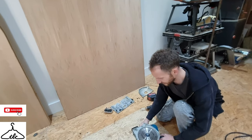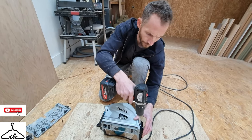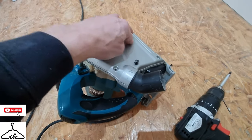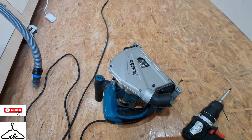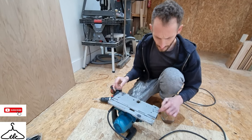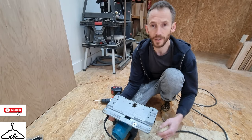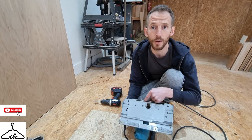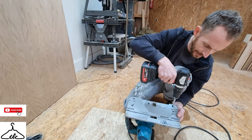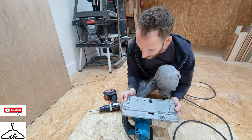Before you put that plate and saw cover back on, wipe off any oil anywhere — grease will just attract dust, stick everywhere, and you'll be back to square one. Put that plate back on like so. Don't forget to put your extractor port in before you screw the plate in — I've just released it, put it in, clipped it back, and nipped the screws up. There's a little bit of play on the screws, so plunge it down on your track and make sure it lines up with the rubber. Centralize the plate as best you can.